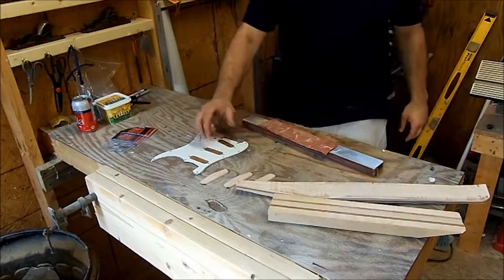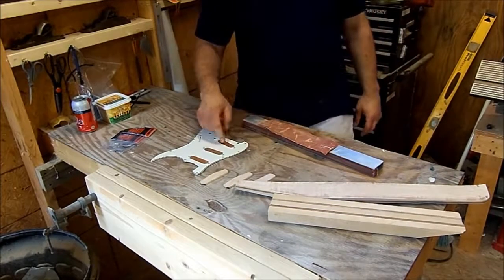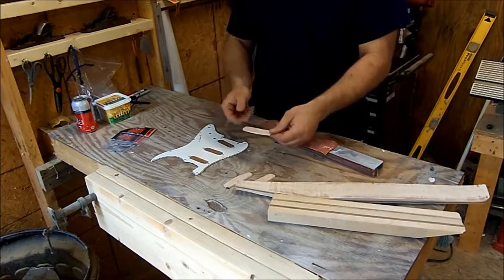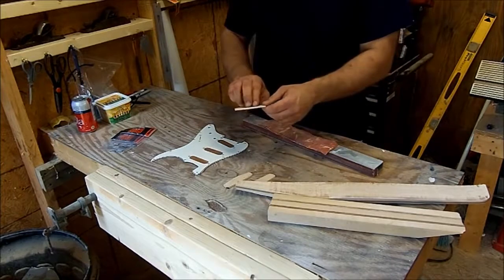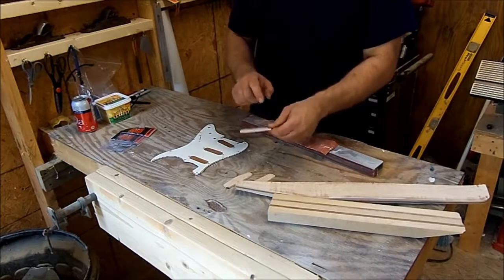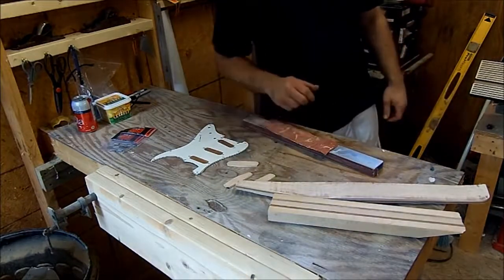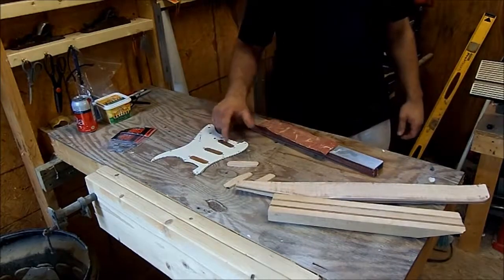Alright, so there's the three tops and they fit down in there. Now we're going to go ahead and start getting the bottoms cut out and sanded down. We've got to drill two holes to put the little ferrules in — or whatever they're called — for the solder hookup. So we'll get these cut down, get those holes drilled, and then after that we'll drill the six holes for our magnets.